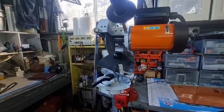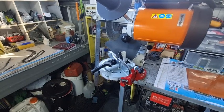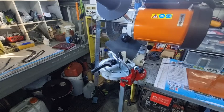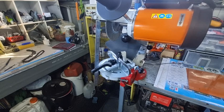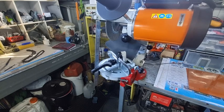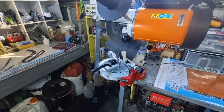So, conclusion time — what's going on here? I don't have anything official from Stihl as to why, when we lower the handle down, it moves five millimeters away from the tooth. There's a user group I'm in with a discussion going on, and the conclusion is that it's doing that because it aids cooling. When the grinding wheel first comes in contact with the working corner it starts to grind that corner, but as you pull the grinding wheel down it moves away from it — continuing to grind only the part necessary rather than grinding the whole tooth simultaneously.